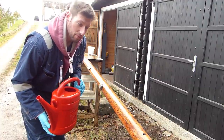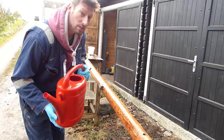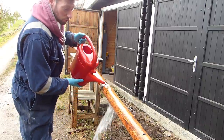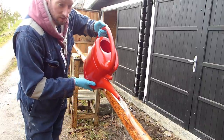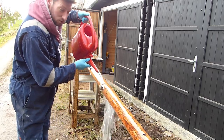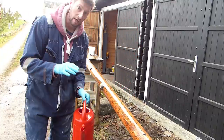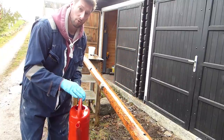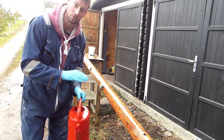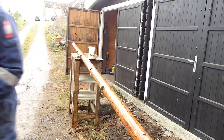Once we give it a quick rub down, next thing to do is just wash off and wash away all that acid. And when I say douse, I really do mean douse. I mean pour on water, like you're trying to put out a house fire. I want that water to soak right into any acid trapped in the fibres of the wood. I want to make sure that there's enough water there to dissolve further and dilute that acid away down to zero, okay? So, loads of water.